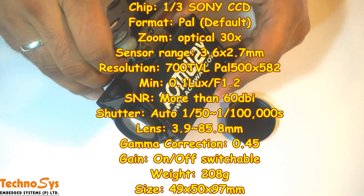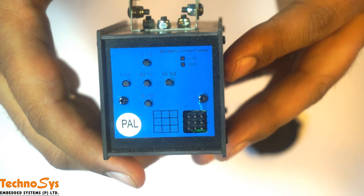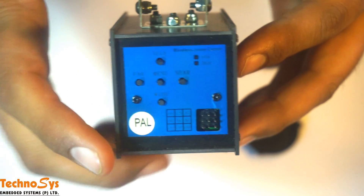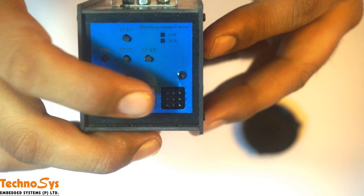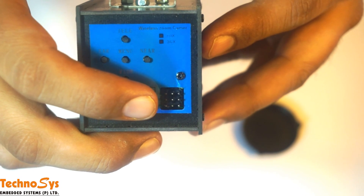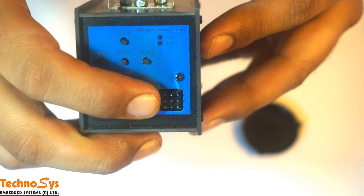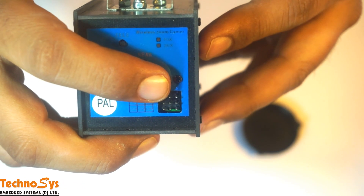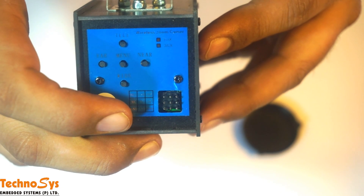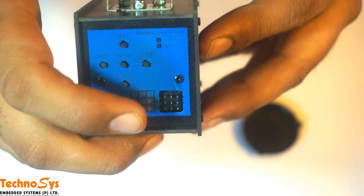The specs are on your screen. Let me explain the connections — they're pretty straightforward but not very well explained in the manual. There are mainly three ports. The first port is labeled ADJ, which I believe is for adjustment, and the JR cable from the RC goes here. The center port is for power — it works on 12 volts DC. A 3S battery at around 11.1 to 11.2 volts will also work fine.